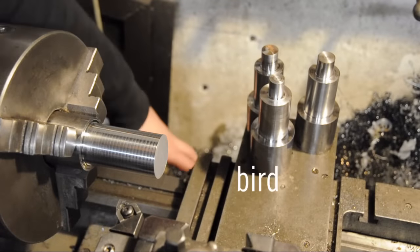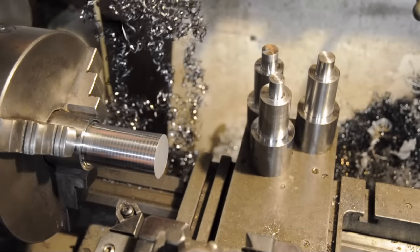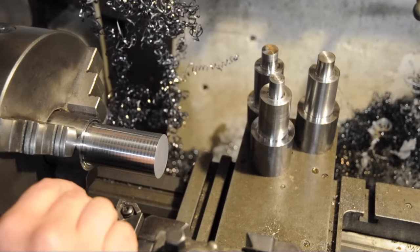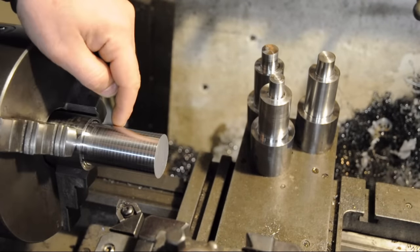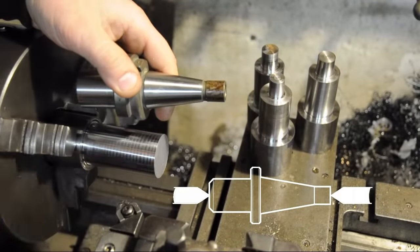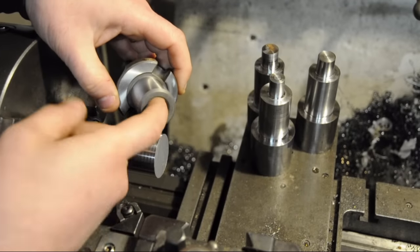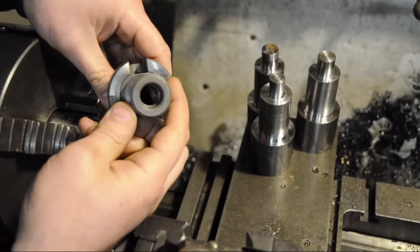As you can see, the bird nesting factor for this chromoly is pretty high — it's not all that fun to work with. There's a lot of stopping and clearing chips before they get out of control, though I found if I bump the automatic feed to give it a little hiccup to break the chip, I can do a lot more turning before a major buildup. I've already roughed out half of three, but my inserts are starting to spark out. My initial plan was to turn these between centers to get as concentric a part as possible, but it turns out that really wouldn't have helped much because the critical diameters are the taper and the inside feature.